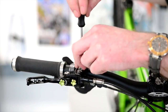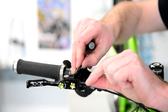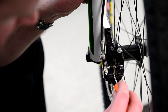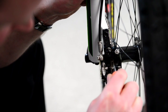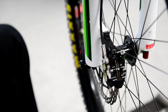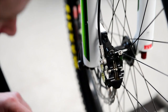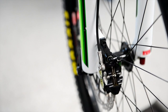Sometimes you can find that your oil level has gone down slightly. What we're doing now is removing the cap so we can do the final finishing procedure of filling the cap and rolling the diaphragm in properly. Just make sure that you don't drip any oil anywhere - be careful with that oil because it can ruin paintwork. Push all the pistons back using a screwdriver pressed between the piston and the back plate of the pad. Don't use a screwdriver between the pads as it can damage the surface, and be careful not to chip the edge of the pistons because they are phenolic and can be quite soft. Take a tissue to soak away any excess oil in the bleed nipple itself, as that can dribble out later and contaminate your pads.